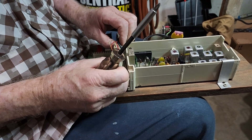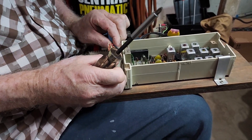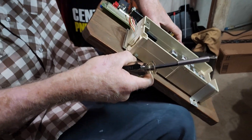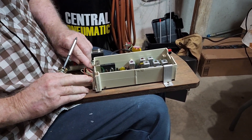You can see this piece of plywood with the power regulator on the left, and there's also a black connector on the PCB that we can hook up the test equipment to and begin the tuning process of those coils in those silver square rectangles. Connecting the connector and then we'll apply 12 volts and go through the tuning process for this exciter.